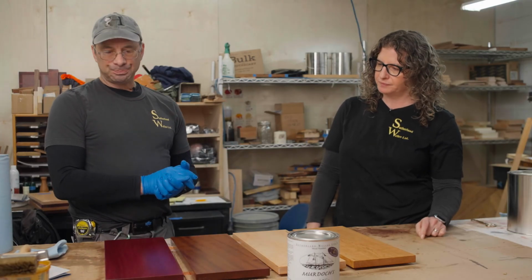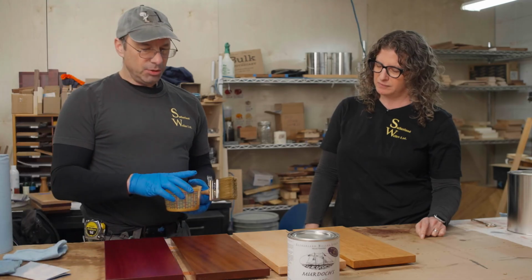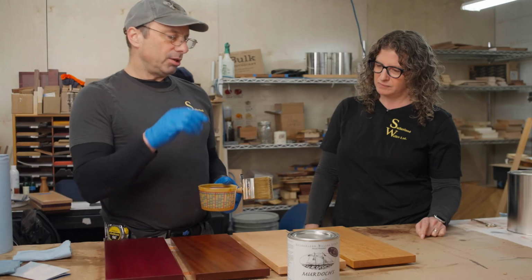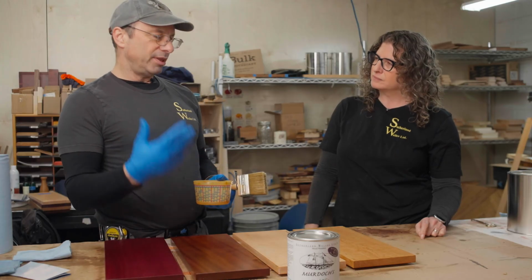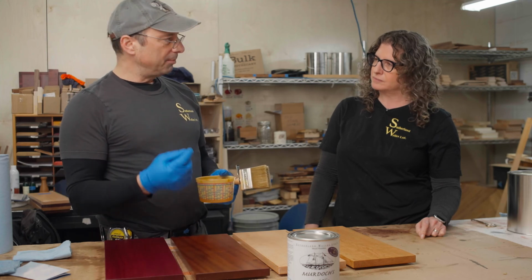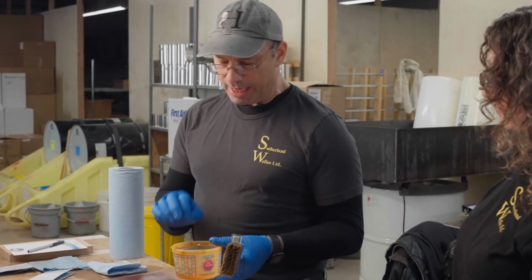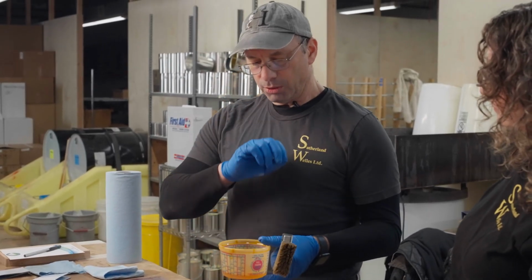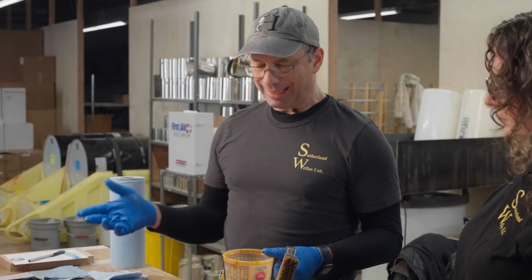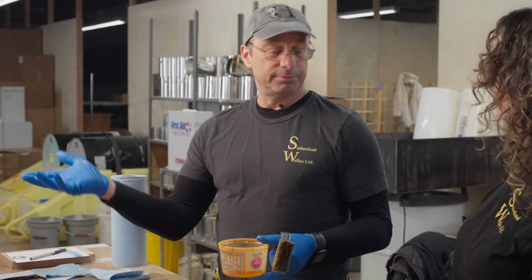Okay. Right. So hard oil, like our other finishes, you can apply using a brush, a rag, a sprayer, or synthetic pads. But like all of our finishes, you want to make sure it goes on nice and thin. This is a blend of our resin as well as our tung oil. So you can go back to it after about 10 minutes or so and brush or wipe it again. But you can also just apply it and leave it, right?